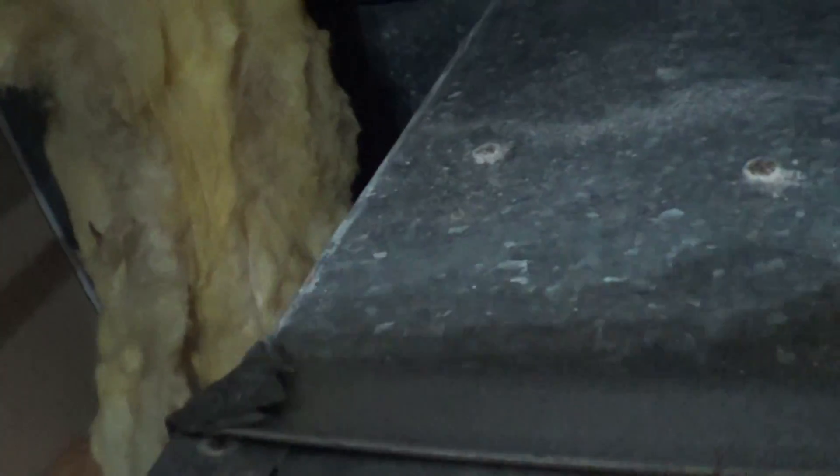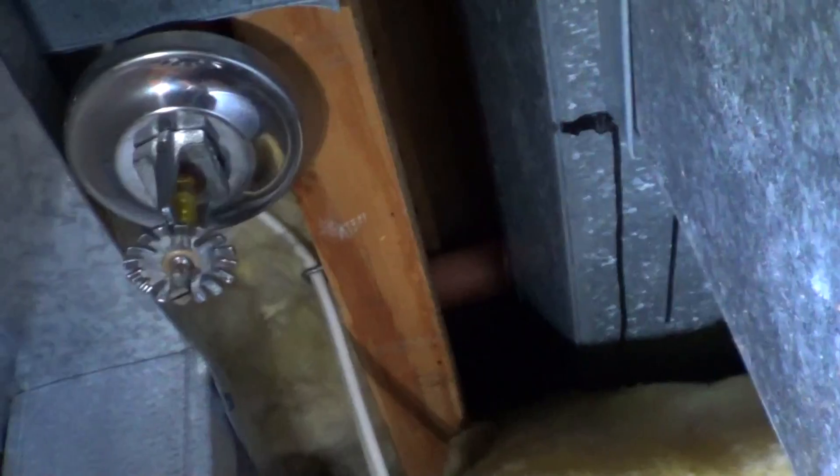The fire damper is open which is good. There's the fire damper and I'm going to check — I'll stick a camera up in the duct to make sure the duct is connected, because I've seen them not connected at the top. Where the joint was, it was kind of hard to connect and they didn't finish it. Here's the fire sprinkler and it looks like it's been converted.